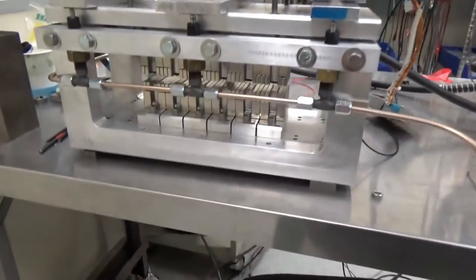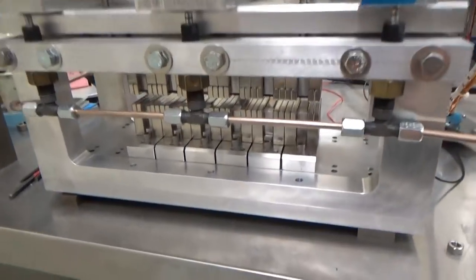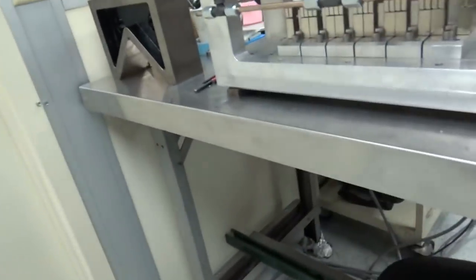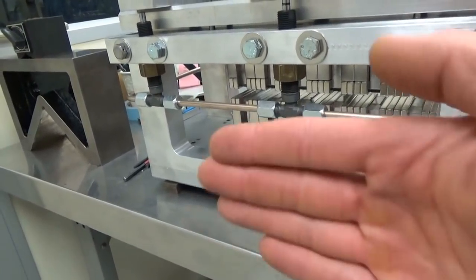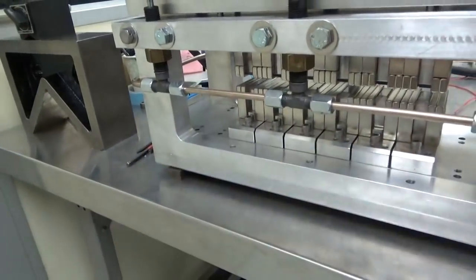This is an assembly of magnets. Now, what would you need magnets for? This assembly is designed to create X-rays from a passing electron beam, and then the X-rays are used for imaging and other scientific purposes. What this array of magnets does is, as the electron beam passes through, it basically wiggles the beam, and that produces X-ray radiation.